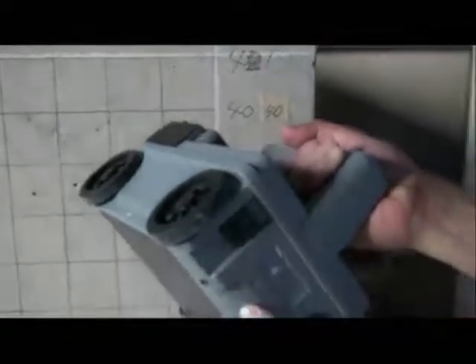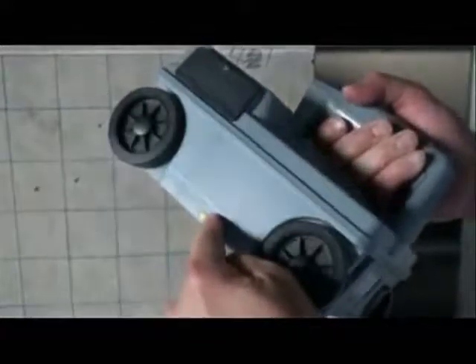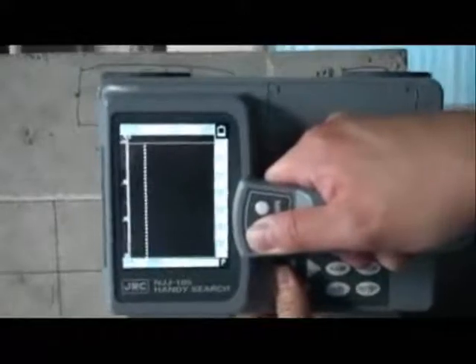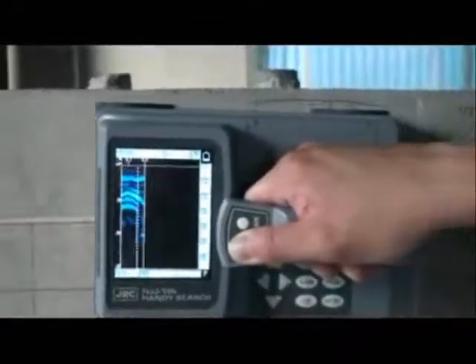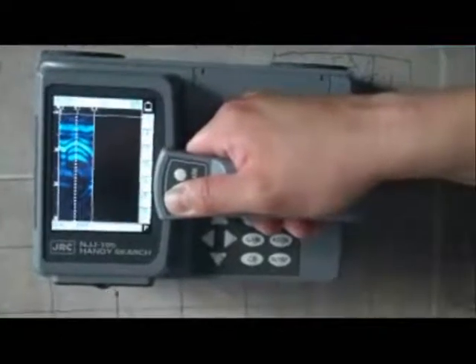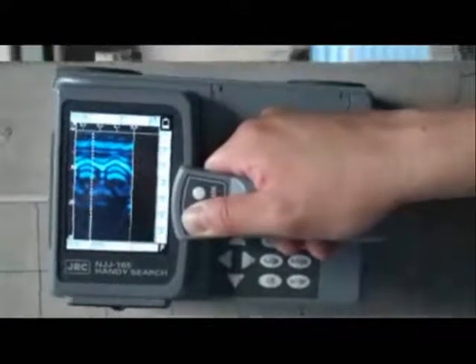In the case of scanning a wall, make sure your rear marker is lined up with the intended scan line. The side marker is lined up with the starting position. Press the start button to start your scan. Mark the point directly behind the rear wheel, which represents the object indicated by the fixed cursor on the display.